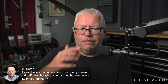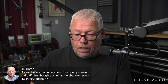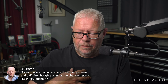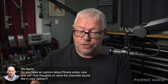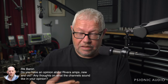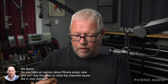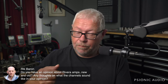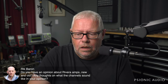Hey, Rick. Yeah, Rivera amps, I think they're good. I mean, they're so much better than the Rivera-designed Fenders. Not every voicing choice that Paul made is a voicing choice I agree with. And I have some reservations about some of their models because they'll use a specialty pot which is not available from anywhere else. If the amp does not have that specialty push-pull dual-gang pot, some of the functions aren't available anymore, and it's really hard to retrofit a different pot because they made choices to use very specialized components, many of which Rivera still has in stock and can sell to you, but not all of them.